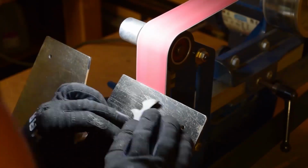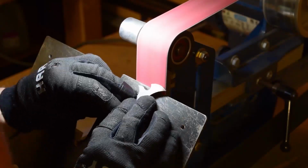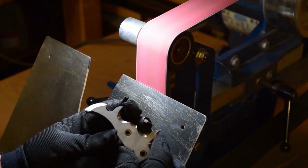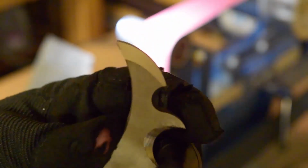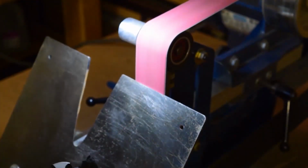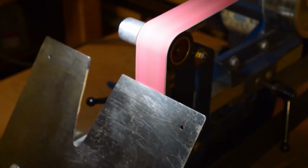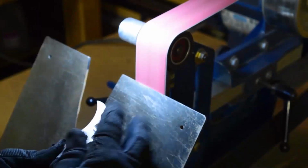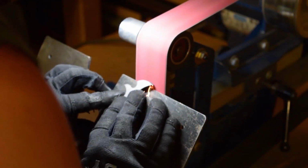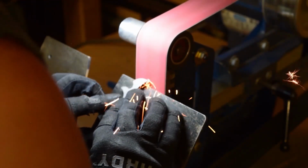And this particular grind, I was trying to go real heavy on the outside. I kind of have that face of the grind taper as it comes up. Yeah, there we go. So I didn't necessarily use that guideline other than for the tip, just as a point of reference, the tip won't be ground any further than this line. So I'm going real heavy at the edge and then just real light as I curve it back around.